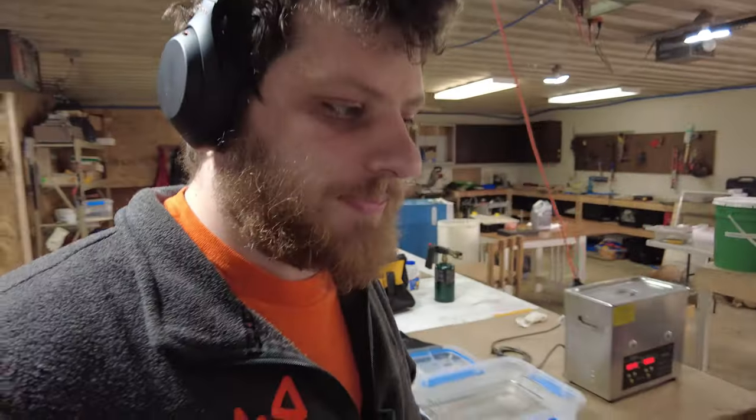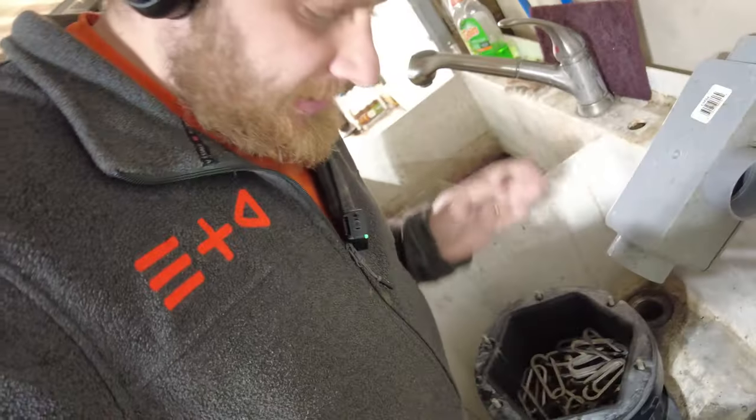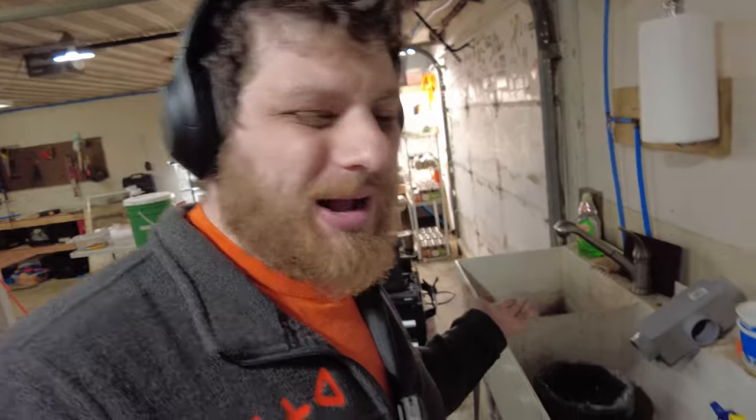These are all done and the next step is to send them into the tumbler. We put them in the tumbler because there are some sharp edges left from the laser cutting and those sharp edges — much like the tabs — can damage the aluminum fixture. Titanium is harder than aluminum so it has a tendency to eat into the fixture whenever it gets a chance. Tumbling will round off the corners a little bit and knock off some burrs, extending the life of the fixture. These will tumble for about two hours.